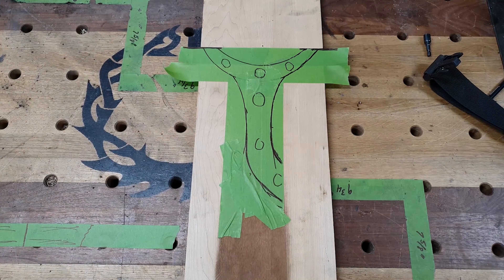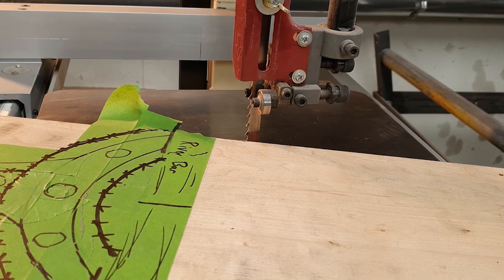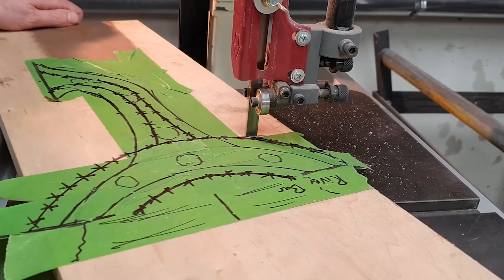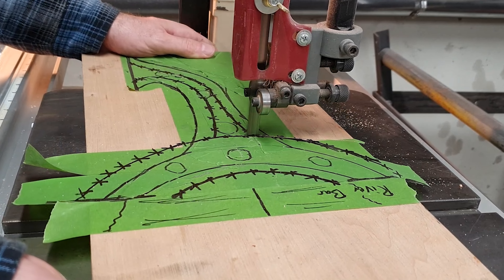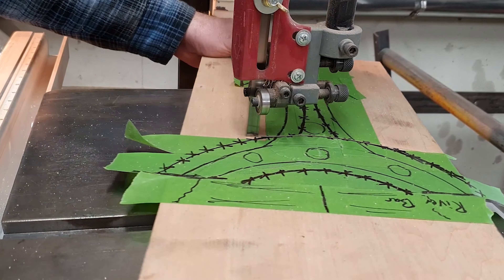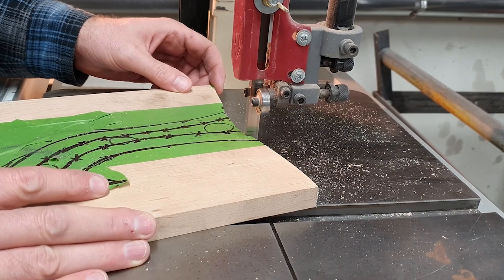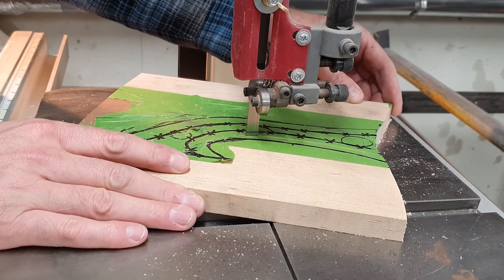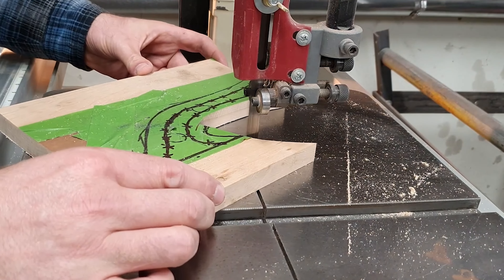The first step was to envision it in my mind and then draw it out on a piece of paper before I started to engineer it. I took painters tape and drew out to scale the outline of the bracket. I started cutting out the bracket templates out of pine on the bandsaw. I can make any last-minute tweaks before I start cutting any metal. I'm cutting my template in half — I did this in two parts because the metal is only wide enough to cut each section out individually, and then I will weld them together to make one piece out of the steel that will be identical to the complete template.